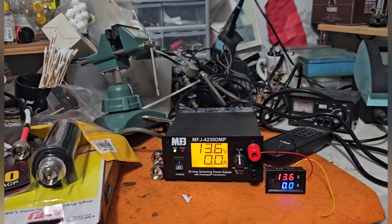All right, I'm going to flip this back. Hey guys, now we're going to talk about this MFJ 904H travel tuner. I'm going to give you a couple of specs before I pick it up. The MFJ 904 is a cross needle SWR watt meter, 50 ohm SO239 connectors, and a tuner bypass switch. The 904H also adds binding posts for random wire and a binding post with a 4-to-1 balun for balanced lines. Also handles 150 watt RF output. Now I'm going to show you this.